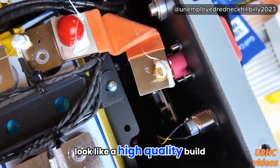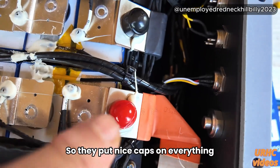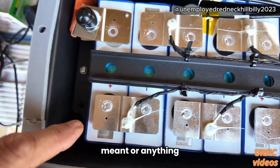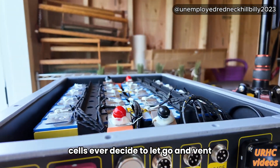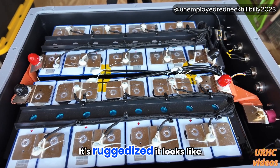This really does look like a high quality build — everything's done right. Wires are all tight, wrapped, and they've put nice caps on everything to protect them from hitting the case should anything ever get bumped. There's a nice gap around the outside for air, and there's a vent on there should the cells ever decide to let go and vent.